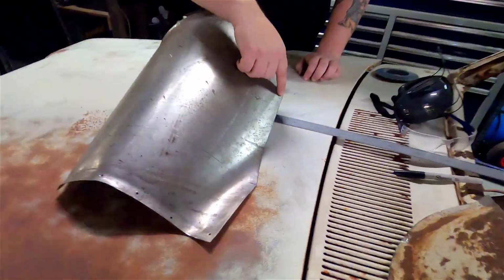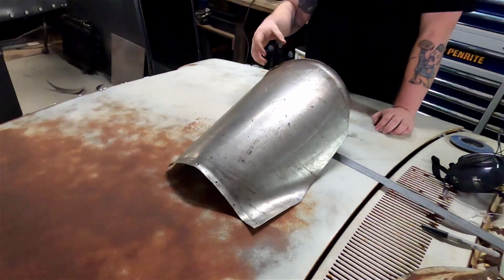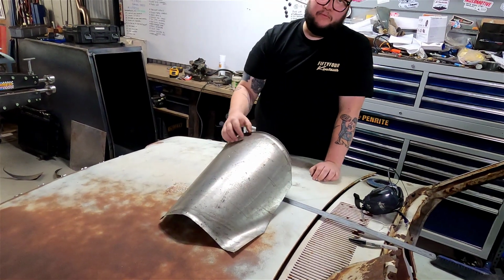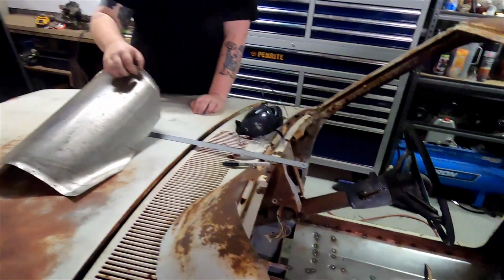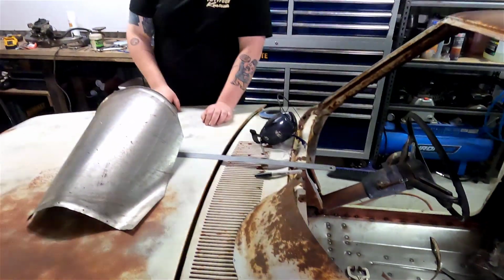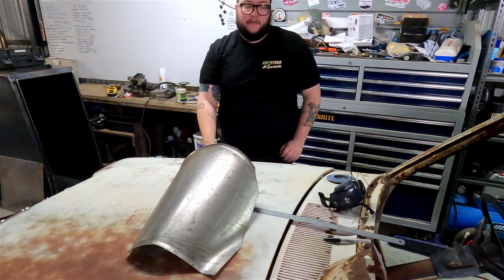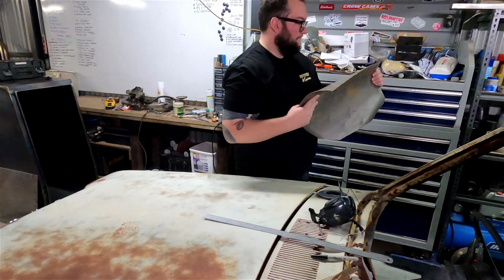We've marked out where the toe board's gonna roughly be. Obviously we wanna keep some symmetry in it, so we've done everything we can to fit it as a flat, which still allows us to get the bead roller in on the edge. We want to keep a 50mm border, just to tie in with the rest of the floor. So it actually needed to be in shape, cut the profile before we can actually bead roll. So what we'll do now is probably get a scratch gauge, mark our 50 in, and then start to bead roll. Let's get it done. And cut.